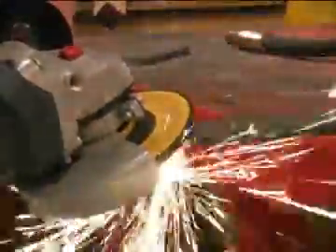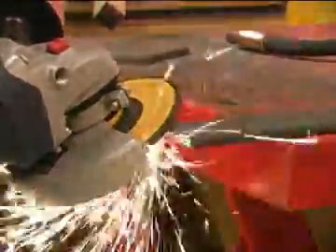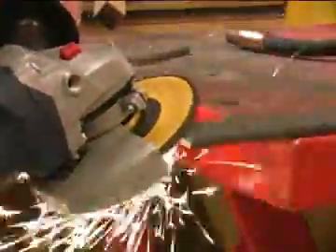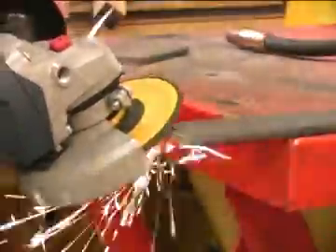In addition to reducing the thickness of the metal to be welded, we want to make room so we can get in there and lay the first bead down the center of the joint. If the metal is very thick, we might have to follow the first bead with two or three or even more to fill up the gap. That's exactly how the pros deal with the huge joints they encounter on things like ships and bridges.